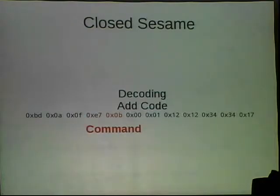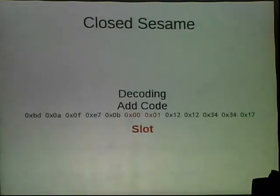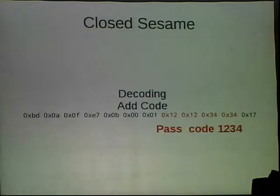And then we found that after every time, there's always this one. So there's 0x0B, and that's the command type that the lock is going to interpret. And then the lock supports, I think, 120 lock codes once you've added the Z-Wave module. And for some reason, it uses 2 bytes to store that. So there are 65,535 options to fill 100 slots. But that's okay.